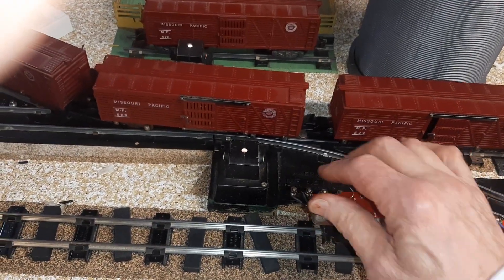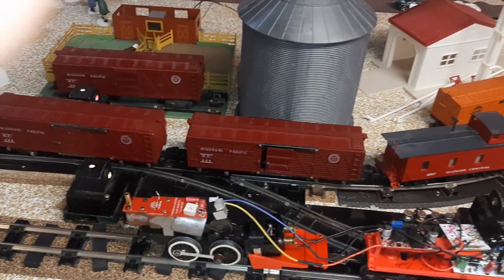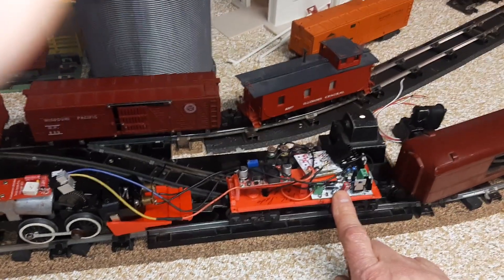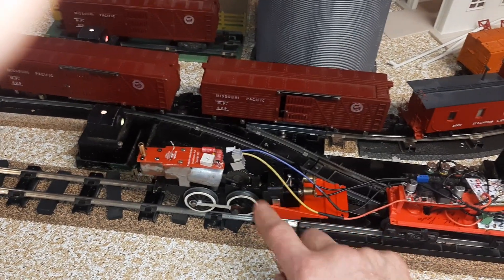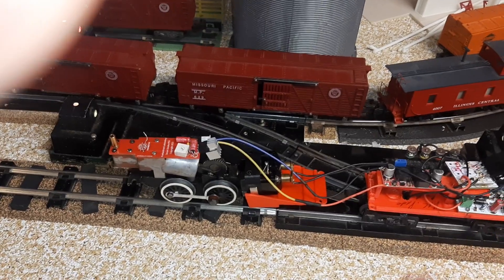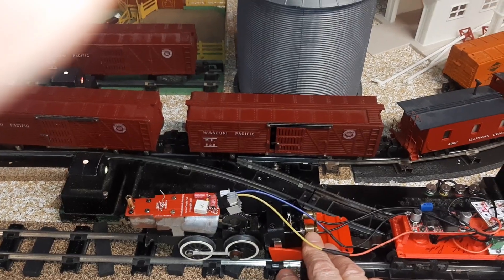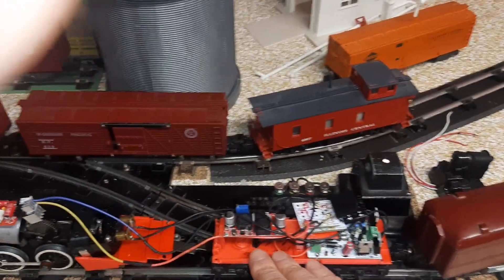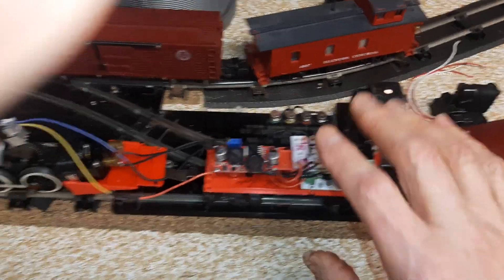It needs a heat sink on it. It's not hot, and this is what it is: you've got all-wheel pickup, motor control, digital reverse, power distribution, AC to DC converter, volt regulator for the smoke. The motor controller puts out DC based on power to the track — that's how you control forward and reverse and speed. These all have little pots for tuning; once it's tuned, I wouldn't recommend doing too much to it. You've got the mechanical puff and chuff. You still have brushes, but the fields are gone — no more fingers, digital — and the conversion to power is efficient and safe, with digital running everything else.